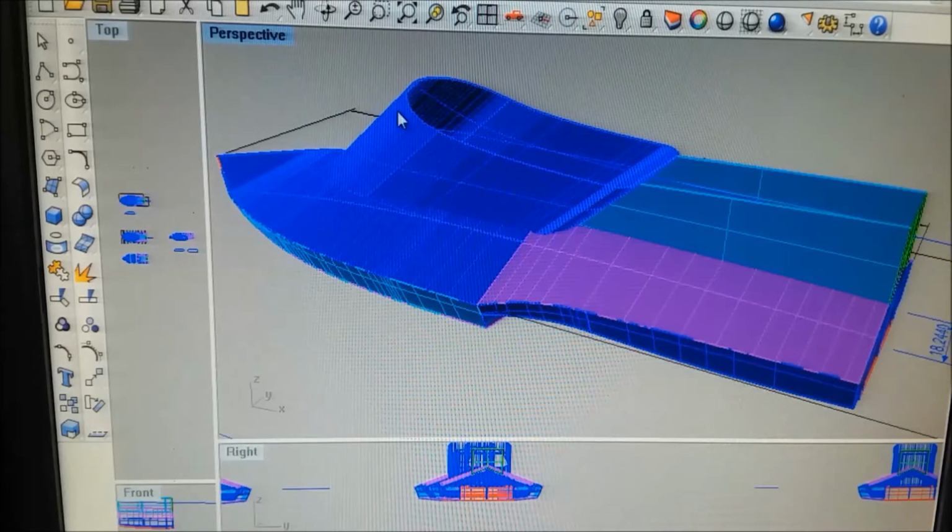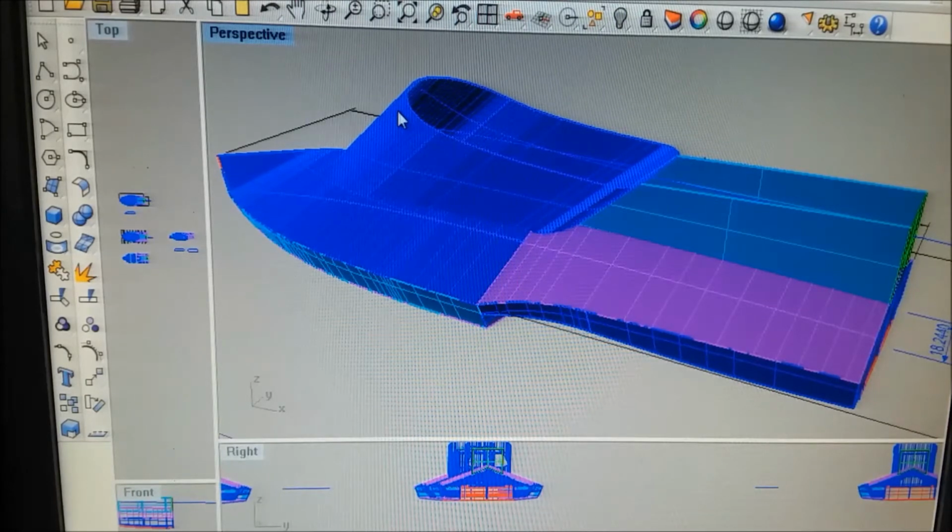It makes it easy to turn, and it cuts drag because that's the only thing that touches the water, the little bit of area near the back of the pods. But it's not very stable. The worst problem they have is there gets too much air under it and it starts to rise, and then it sees more surface area and it blows the boat over on its back. That's why there's no top in the cockpits on these style of boats, so the occupants get tossed off the boat.